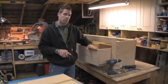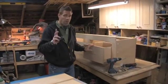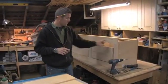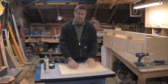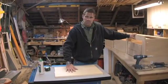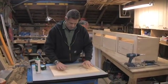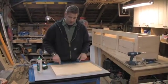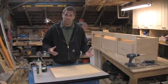but then you can't round over edges. You're stuck with sort of this profile, just very square. Nothing wrong with that, but it'll save you a little money if you just want to use the plywood for that as well, because then you just make one cut. But what we're going to do is take 2 pieces of the pine, same material that we used for the face frame, and we're going to nothing more than secure them together and make it look like a big piece of wood. Make it look like it was one big piece.